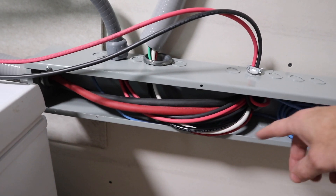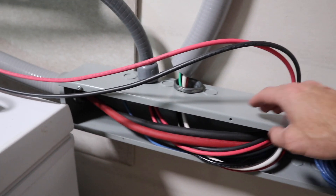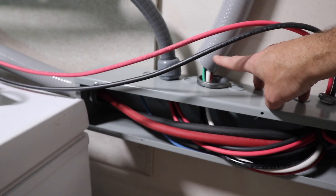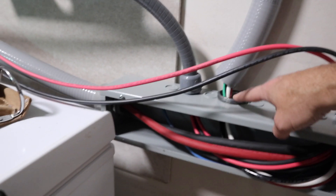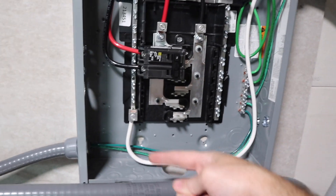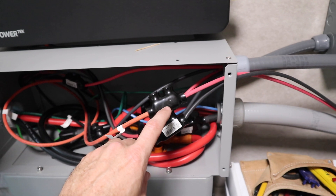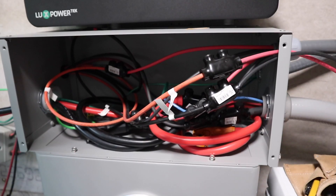Coming in from outside, we've got all of our wires. I did add a third string of PV — I know I need to put it in conduit but I did run out. I also ran out of my inch-and-a-half conduit connectors, so I have a conduit nipple in here temporarily just to protect the wires. All of our AC wires come up into our sub-panel: white neutral going to the neutral bar, grounds to the ground, and line one and line two. I also used these insulated connectors to extend my PV lines, and everything is tucked into this box nicely. These are the CT connectors that come with the Flex Boss — I'm not installing these because I do not need to measure power coming in and out of the grid. My system is completely off-grid.